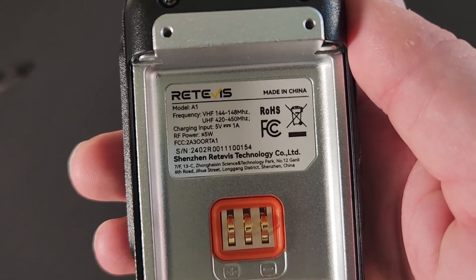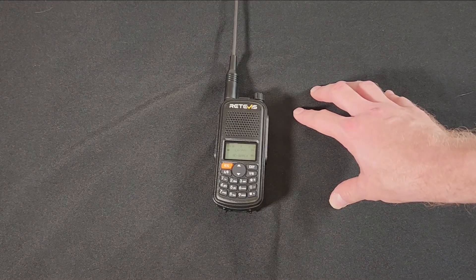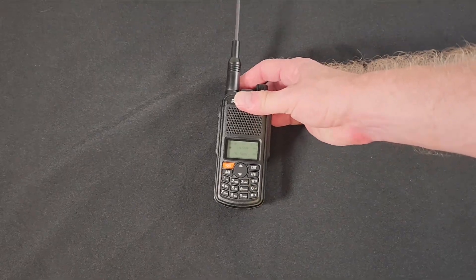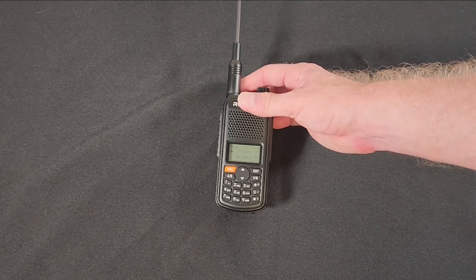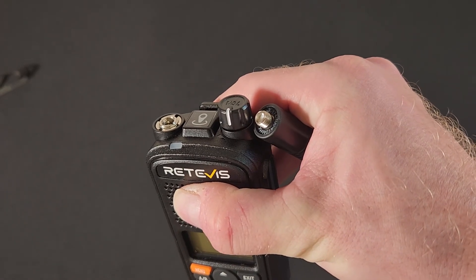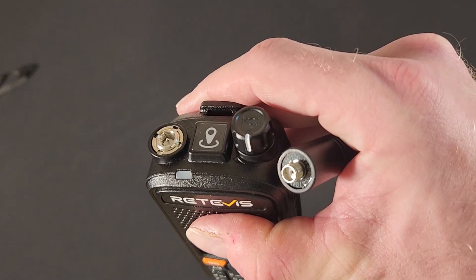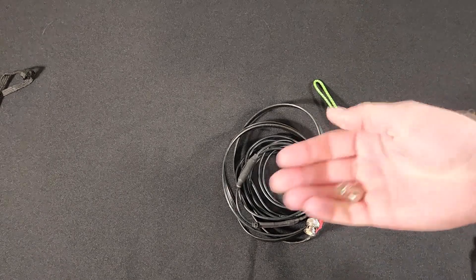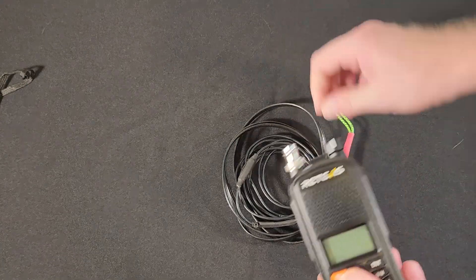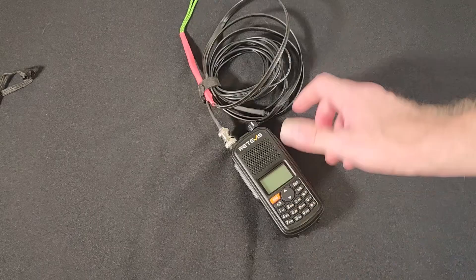It's FCC certified VHF and UHF, and I have verified the power output on this thing. It's locked to ham bands, but you can unlock it — check the information later. It has AM, FM radio, and even AM aircraft bands. So if you like to listen to aircraft, you can do that here. That's an incredibly unique feature that low-end radios just don't have — you have to get into a ham radio to pick up aircraft AM. It uses a standard SMA female antenna, so you can use all your accessory antennas from the Baofeng with this. A roll-up J-pole is highly preferred in my opinion — with an SMA to BNC adapter, I can hook my roll-up antenna on top, throw it up into a tree with some cord and fish weights, and extend my range.